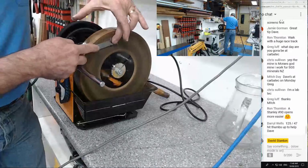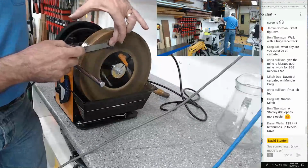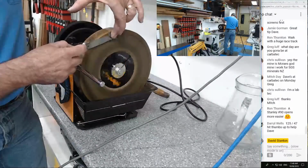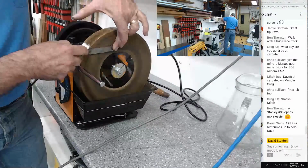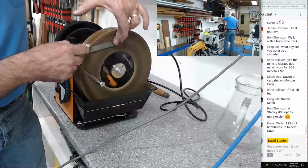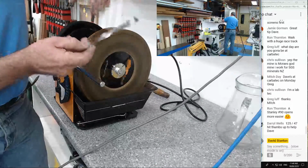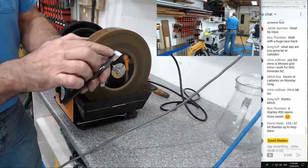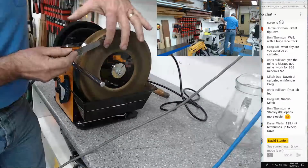So now, instead of putting even weight back here, I'm going to put more concentration where my finger is, and I'm pushing down hard towards the front of the blade. If it was a chisel, I've mentioned this before, I'd have equal weight right the way along the chisel on the back. So it's all flat, especially if I wanted the chisel for doing any paring work. Like this is fine. Planes don't rely on that. See that? That's a whole lot nicer now. Nearly there. We're there across that part, right across just the corner and this corner.